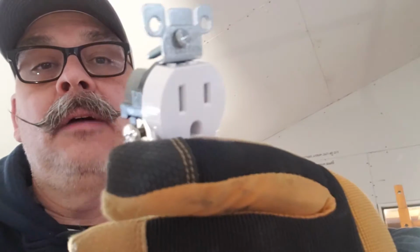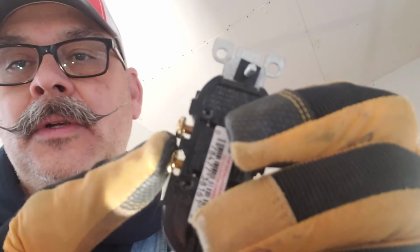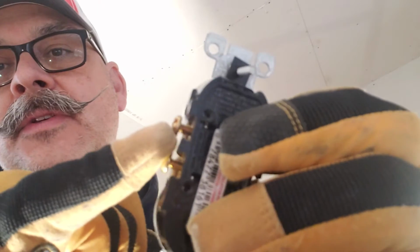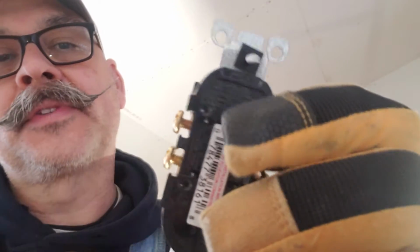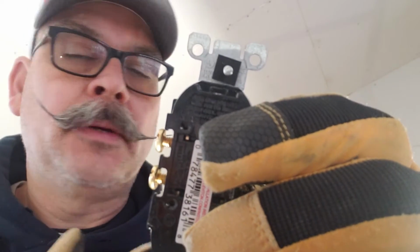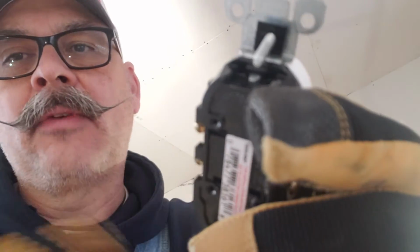In my experience, they're not reliable, so I don't use those connections myself, and I don't know many electricians that do really, because they're unreliable and they're kind of a pain to take apart. So I always use the screws, and even though it gives you 2 screws on each side, I do not use both screws. So if I have 2 wires in the junction box, I don't use both the screws. I'll pigtail it and just have 1 screw on there.